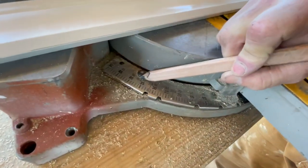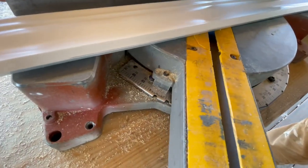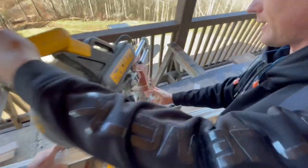If you don't like holding your crown molding tilted in the saw, an alternate method is to use these increments marked on the saw: 35.3 and 31.6. You may have wondered what those are for — it's actually for crown molding, accounting for the two common different angles available. So you can lay the board flat, tilt the saw to one of those marks, and tilt the head — the head has the same markings. You could get those two angles perfectly and cut your workpiece flat. I actually don't like to do it that way. Arlo, what's your preference? I will go with the vertical every time. Whenever I've laid it flat with the compound angles, there's always some little variable that doesn't quite work out.